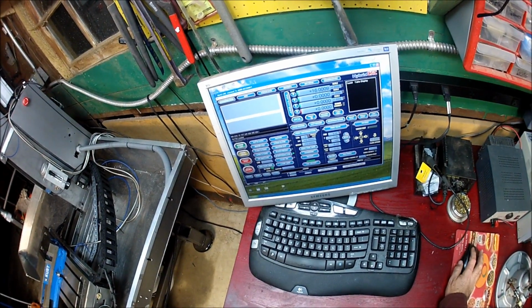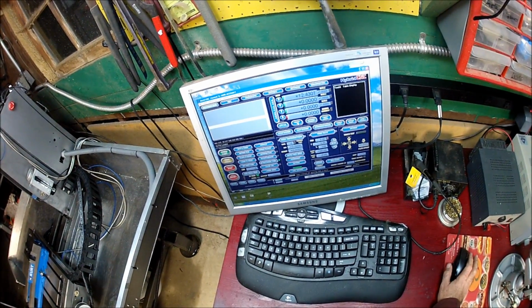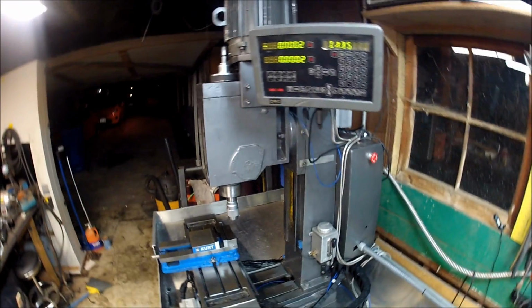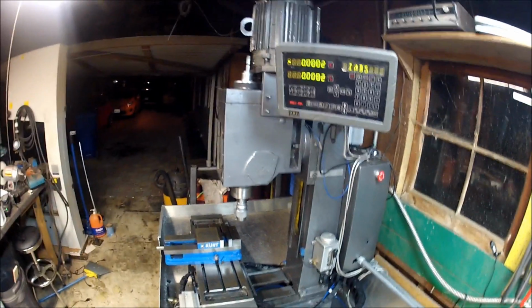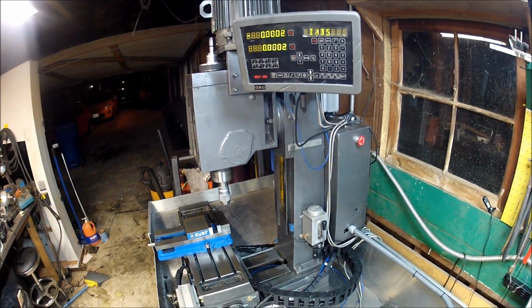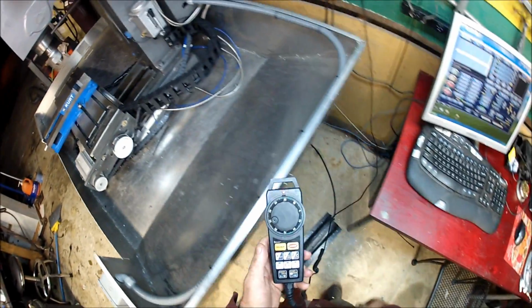Now let's see what we got for backlash. Okay, go ahead and hit 0. Go return to 0. And so that moved. And yeah, so not too bad, roughly 2 10,000ths for backlash. So pretty happy.